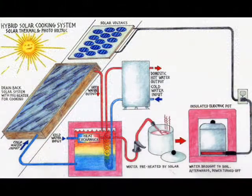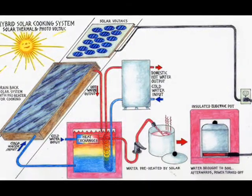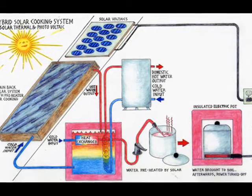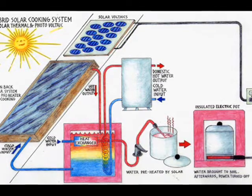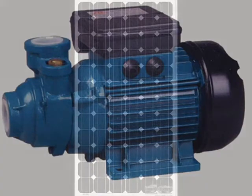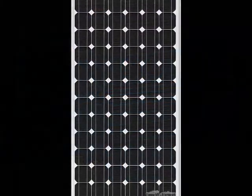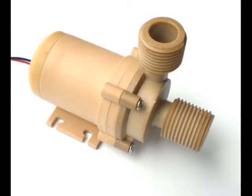The hardest part of a do-it-yourself solar thermal project is getting started. If you're still in the experimental stages, you're probably not ready to make a large investment. You may have built your own collector, but now you may be searching for a pump and a method of regulating the pump. As long as you can maintain the supply voltage between 10 and 14 volts, this low-cost 6-watt 12-volt pump may be just what you're looking for.